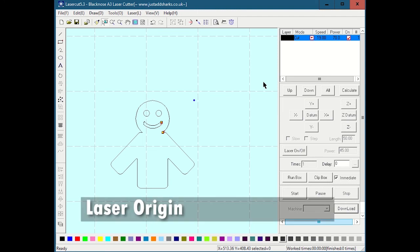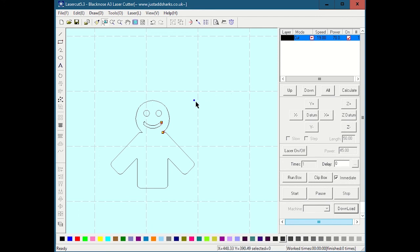If the laser, like we were looking at the laser right now, which we can't, and the laser head was here, and I were to hit test, it traces the bounding box of the artwork that you're cutting. In this case, this blue dot refers to the origin of the art you are cutting. This blue dot means when I start cutting, I want the laser to cut relative to where the position is right now. And that's in fact what this immediate checkbox means. Again, the immediate checkbox means when I hit go, the laser is going to start cutting relative to wherever it happens to be on the bed at that point in time. And this blue dot means basically consider that the laser is starting in the upper right-hand corner of the artwork. So when I actually hit go, or rather hit test, it's going to start tracing to the left and down.